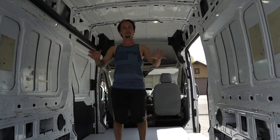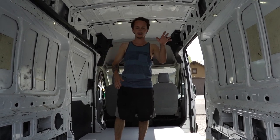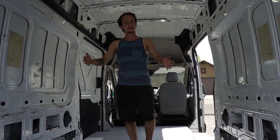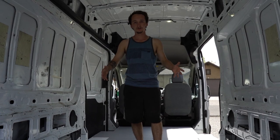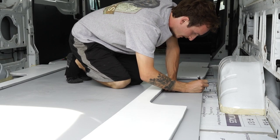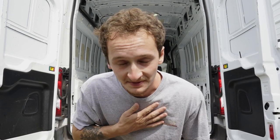We've got the subfloor in place and all the pieces primed — we used two different primers that are the same thing but two different colors; we ran out of the original so we bought more. The next step is to pull each piece up one by one, figure out where the aluminum is underneath, mark it on top so we know exactly where to drill our holes, and then get these screwed down. Ashley went inside to work on editing our latest video, so it's up to Ron to get all these boards drilled and screwed down.